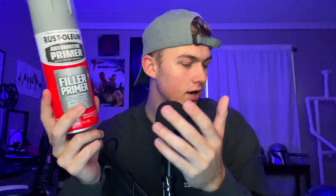The first thing that I did, as you saw, is I used this Rust-Oleum Filler Primer. What you're going to do with this is spray heavy coats of it, because you're just going to sand it off. You're going to spray heavy coats, sand it, and then wash it. And you're going to do that on repeat until you finally get to something that you're happy with. Honestly, mine isn't the smoothest thing in the world, but if you don't get really close to it, you're not really going to notice the layer lines.